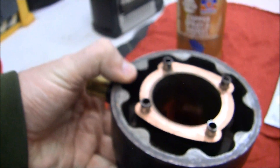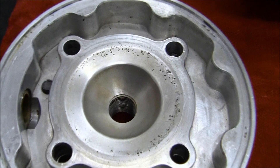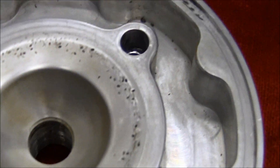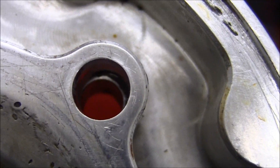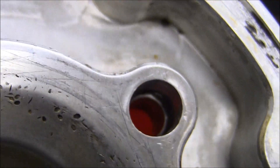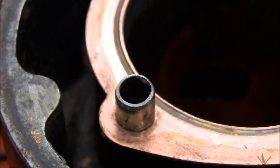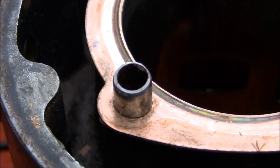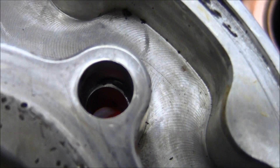Normally this head right here — these holes were too big for the studs. What I did was I took a drill bit and, you can see down in there, I drilled about a quarter of an inch deep, like these right here — quarter inch deep — so that the head would fit these studs.